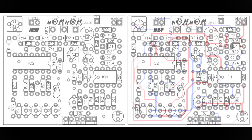To get a proper phasing effect out of this unit, you're going to need 4 JFET transistors that measure the same value. From some sources you should be able to buy them pre-matched, but otherwise getting a big batch and measuring them out until you have 4 of the same value is the way to go. There are two internal trimpots: one to dial in the right voltage for the optimal amount of phase, and a second one that tweaks the intensity of the feedback switch, which you can adjust to taste.